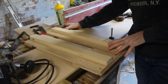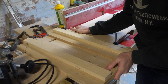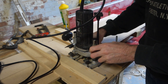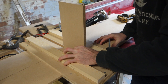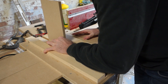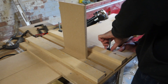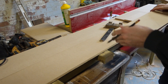Let me show you how this works. I've got a sliding square side so I can place that against the piece I want to cut a housing in, run it along this edge, then switch over and run it along the other edge — that gives me a repeatable housing. Set the thickness, get it square. You want to be careful not to set this too tight otherwise you'll never get your housing in. I'm going to make another jig but this time with 300mm spacing.